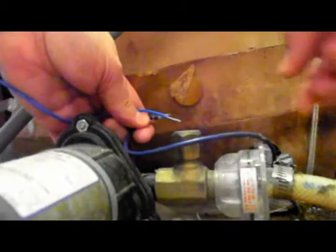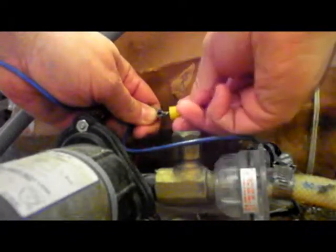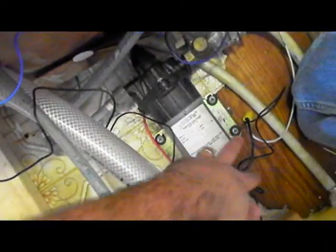Wire nut off. I'm just going to wrap this in line — same direction your nut is going to go back on. I don't ever use the water pump; always hooked into either city water or I just carry jugs along. Let me screw that down — finger tight, not too tight; I've actually ripped them off before. Go finger tight and give it a little tug. If nothing pulls out then you're all set. I'm going to do the same with the ground. Alright, I got our hot and ground connected, nice and secure with the wire nuts. We are ready to run our wires.